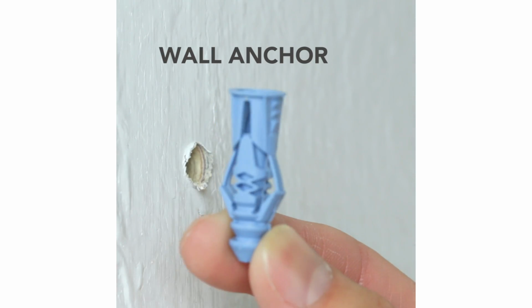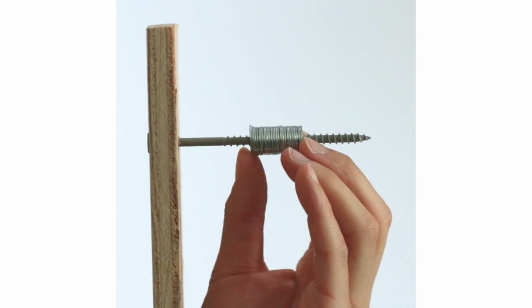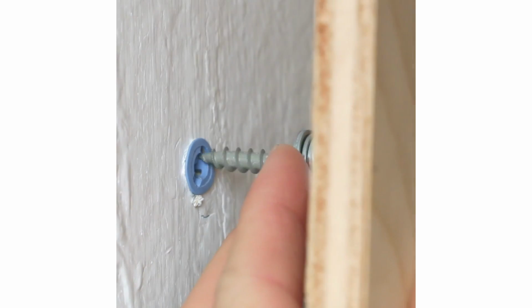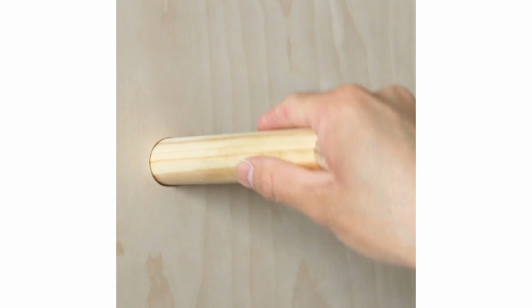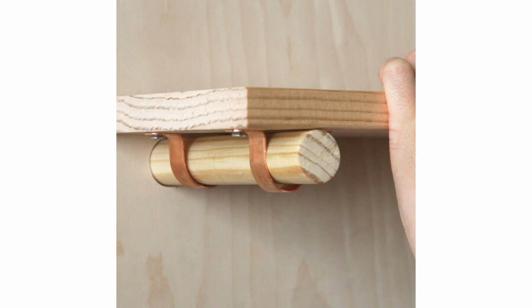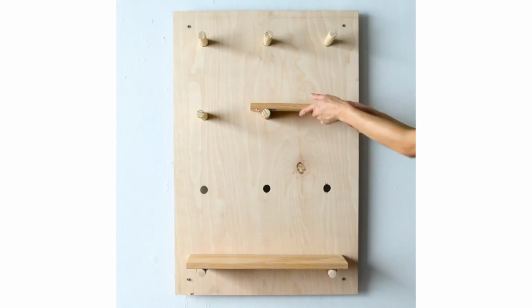Okay, cool. I used a ton of washers for the video, but you could just use thicker washers. The thin ones are just what I had available and they did work at the time. But when you're hanging up the shelf, I recommend taping a leveler on the top edge of your shelf because then you can actually see if it's leveled or not. Put it up against the wall, make the marks where you need to drill, and then put in your wall anchors, and then secure it to the wall just as normal with the wall anchor.